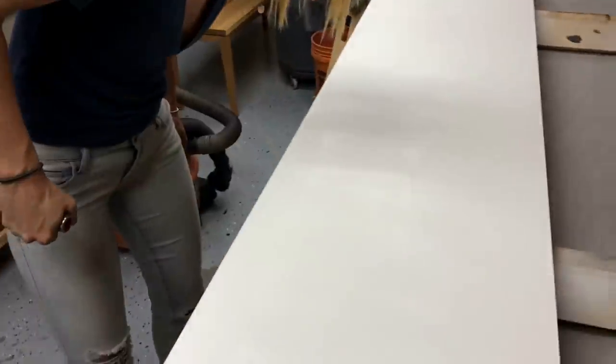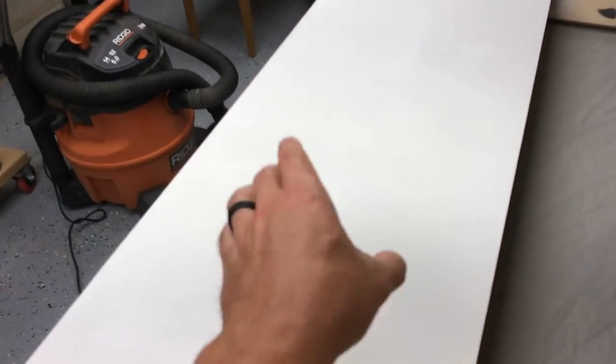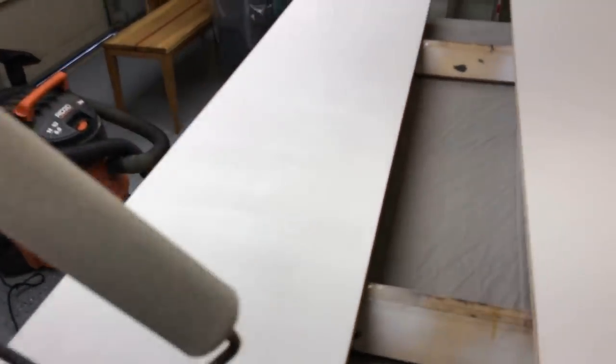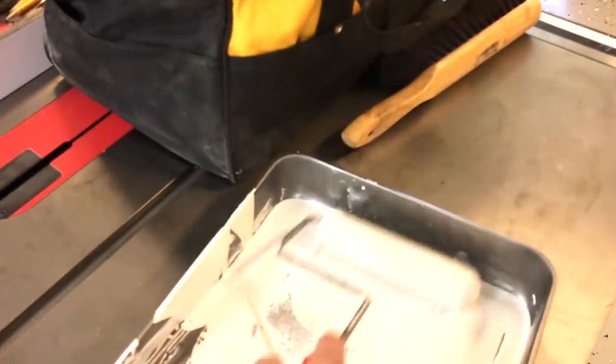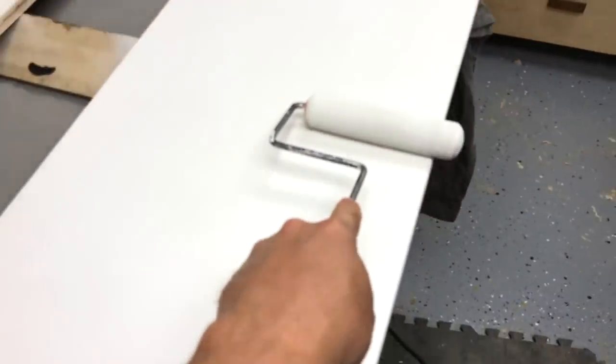Here's a painting tip: when you come back and tackle little spots at a time trying to touch up paint, you're going to leave yourself a very uneven finish. When you get towards the end and come to finish, do the full stroke so you always have a good even spread to get rid of all those little individual strokes. And with that tip shared, Taylor takes over completely for the painting.